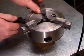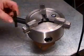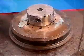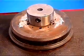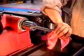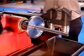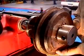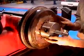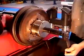The quick chuck is now ready to handle 3 quarter and 1 ton hubless drums and rotors. Install the quick chuck to the drum or rotor using the method shown earlier. Place the large backing plate onto the arbor. Install the quick chuck and drum or rotor assembly with the appropriate spacers. Complete the setup by installing the arbor nut.